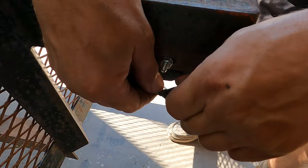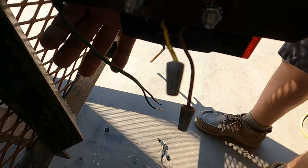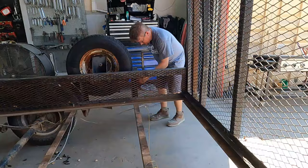Maybe the only thing better than scotch locks is wire nuts. These are the kind you get when you purchase a cheap ceiling fan. If you do purchase a cheap ceiling fan, get your own wire nuts and throw these things in the trash. More scotch locks. Had to do a little wire extension here — that one was working good, as you can see. So what we're going to do is not splice that wire on; we're going to cut it off, put a new piece in, and make one clean connection. These are spliced as well.